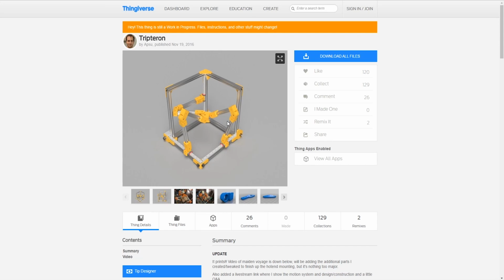And if we drop the weight, we have our basic equation of force equals mass times acceleration. We have a certain max force that we can get out of the motor, right, and if we drop the mass, we can get more acceleration. That's just how it is. The only thing we have to watch out for is how much bending these things do when you're throwing that momentum around, stopping the momentum, accelerating out, and just driving these forces.